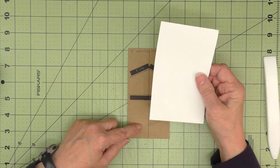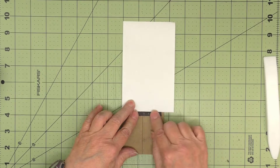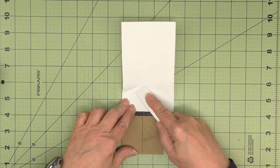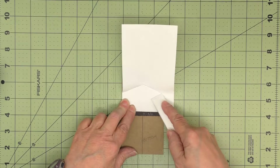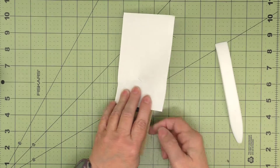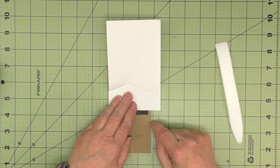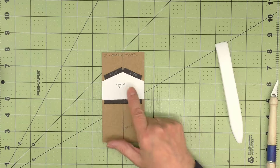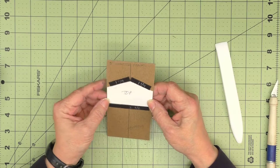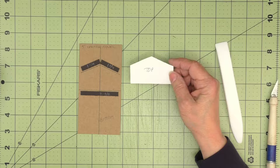We want it to fit right up against these ledger strips. To make a pattern for that, I'm just taking a lightweight piece of paper — printer paper or anything lightweight — and bumping it up right against that line at the top of that ledger strip. I'm using my fingernail or bone folder to go right up against those two ledger strips, so we'll get a pattern for the piece of paper we want to put in the back. Just hold it in place and mark where you need to cut it off on the side. Use those creases to create a pattern and check that it fits. I wrote 'top' on it so I know which side faces out, just in case the ledger strips aren't exactly precise.